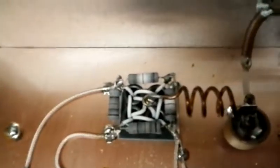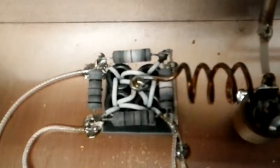Every combiner resistor is burnt. There are 3 burnt that I can see. Splitter resistors. They even burnt the feedback resistors. 1, 2, 3, 4. Look at them. I mean, come on. Every transistor in the amp is blown.